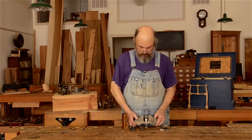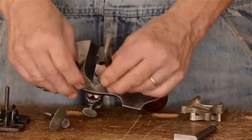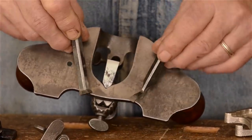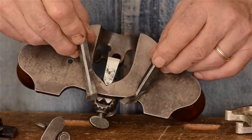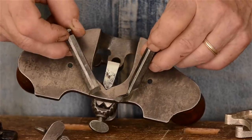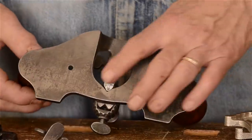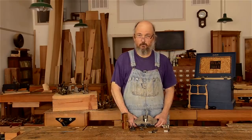The planes came with a variety of cutters — I've got three examples here, one of which is already in the router. There's a narrower cutter and a cutter with a spear point type edge. The spear point makes a very slicing cut, producing a very fine surface at the bottom. You can find these at old tool shows, but often a router you find at a flea market will just have one cutter. That's not a problem — as long as you have a cutter narrow enough for the narrowest groove you're going to cut, you're in business.